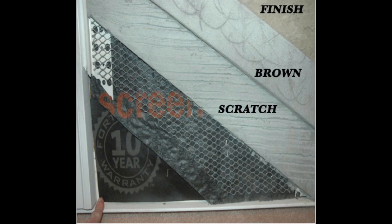Before we take a real close look at the finish coat, let's take a look at the entire wall system. By code over wire lath, we need a three-coat system: a scratch, a brown, and a finish. The scratch is mortar or plaster applied first, allowed 48 hours to cure and shrink, and we get any hairline cracks that occur at that time. The brown coat is then applied and allowed seven days to cure and shrink — again, any shrinkage cracks occur. The theory is the finish coat goes on last, and at that point no shrinkage cracks should reflect through.